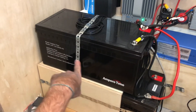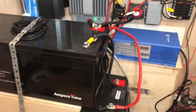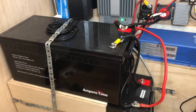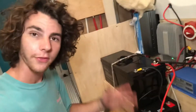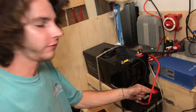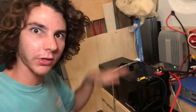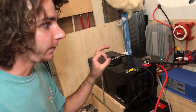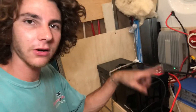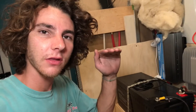These are 200 amp hour batteries — 400 amp hours total. Right now I've run my fans and my lights, and so far it's been working great with my solar going directly into it. The reason I chose a 24-volt system — a big one — could be the cost. A 12-volt system requires thicker gauge wire to connect all your components, but in a 24-volt system, since it's a higher voltage, it reduces the amount of current, so you don't need as thick a gauge of wire. Thicker gauge wire with thicker lugs and connectors significantly increases your cost.